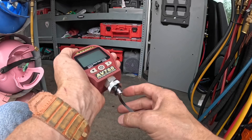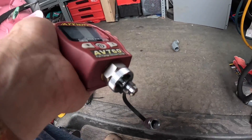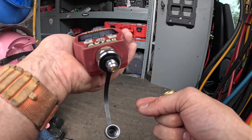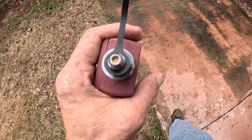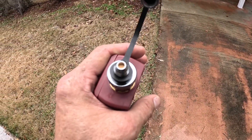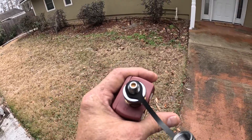With some of the others, like my MG44, it never did go back to reading like it used to, even after I cleaned it. So I really like that you can pull that out and more easily clean the sensor, and you can replace that little cotton-like film. That to me was a nice improvement. There is also another filter in there, so it just makes it a lot harder for oil to get on the sensor. That has been a huge problem on every micron gauge I've had. Well guys, that is so far my favorite micron gauge. I hadn't tried the other one that people have been recommending — Blue something or another — but between me and Riley, that's our favorite so far. Thanks for watching guys, and I'll catch you on the next one.